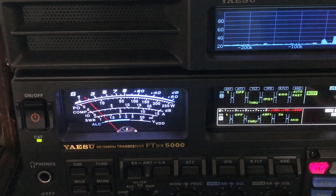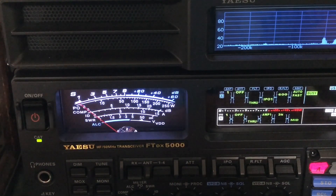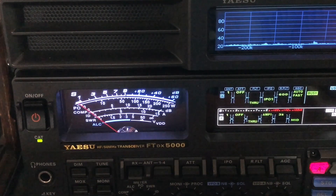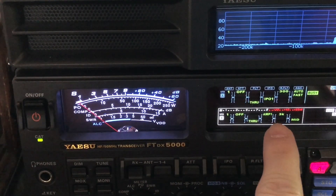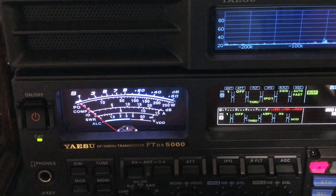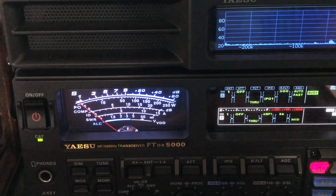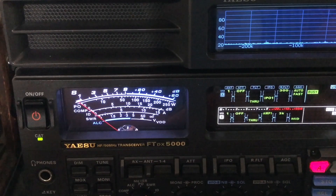I won't kid you — I had to work him with headphones on. It was barely above imaginary. Probably the ghostiest of ghost signals I've ever worked. It looks like he's given up, but you got to hear him and hear what I was talking about with the super narrow. Right now the only thing engaged is IPO and APF. I'm going to turn the width down to 50. Digital noise reduction at 15 — I sometimes might turn it down to 10 or 12, just depends on how quiet it is. Listen to that. I've got the volume wide open. Let me tune a signal in — you can hear how quiet.